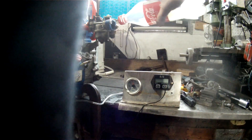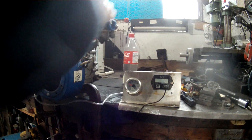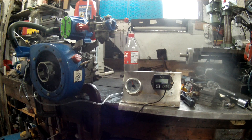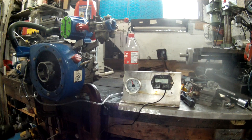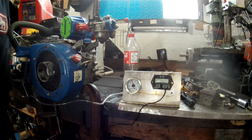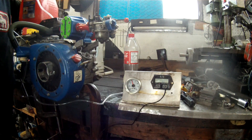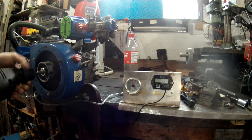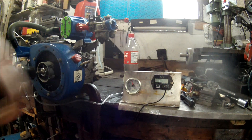Before you guys go, I want to note that I haven't forsaken the centrifugal supercharger. I just wanted to try something I think I can manage a little more longevity out of. I do plan on sticking that system on the GX200 engine as well and building a metal box to stick it all in. This roots blower design doesn't hit the maximum RPM on the bearing, so I should be able to hold it together for a decent amount of time.